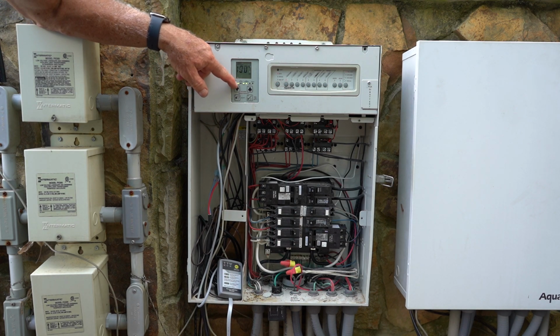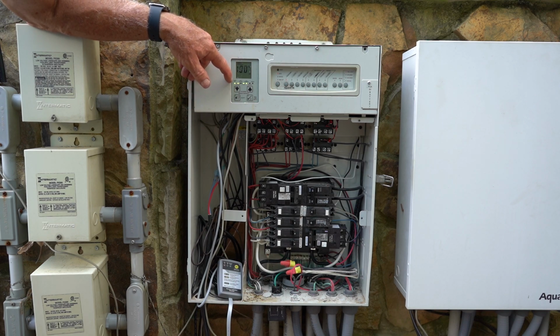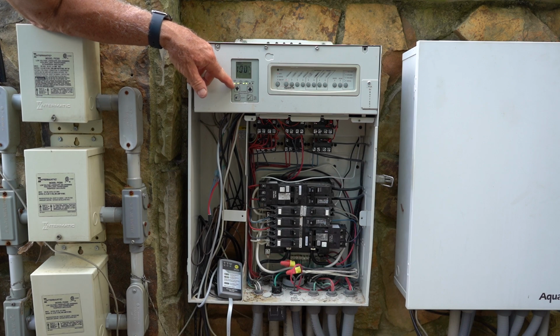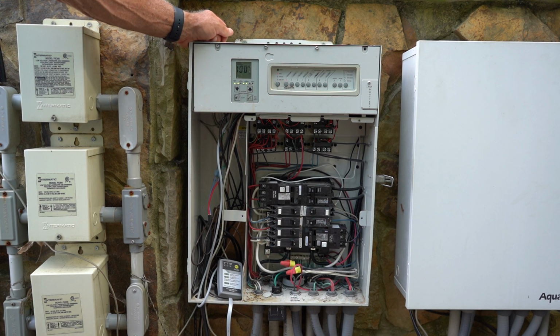You'll see that all our lights are on. Our cell light is on. Our flow light is on. It's actually cell reversing right now. That is going to alternate on and off depending on which cycle it's on. Every 4 hours or so, it flips from one direction to the other direction. So at this point, everything is fully functional with this. We've got power on, cell on, flow, and cell reversing. There are no errors that are coming up. So, job done.